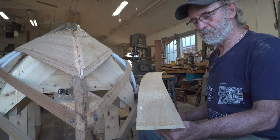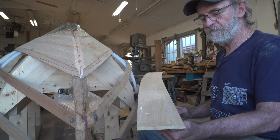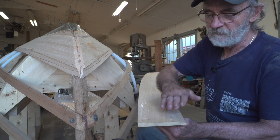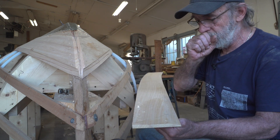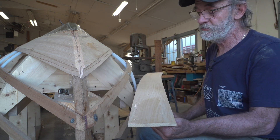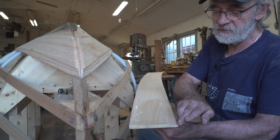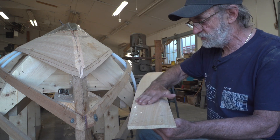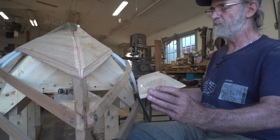I'm back on the starboard side. I've got the first piece of binder strake cut out, the gain has all been planed in, and I've fit it already once or twice. I've hollowed the forward end of this plank because the stem is still round and fitting a flat piece to a round stem and getting it to bend is a little tricky. Since I didn't laminate this plank like the one below it, it doesn't cup as easily, so I hollowed this end out. It should go on there really nicely — let's try and clamp it up in position.